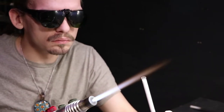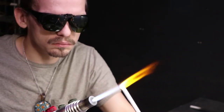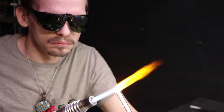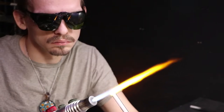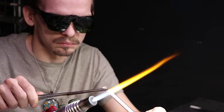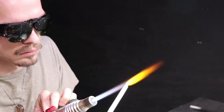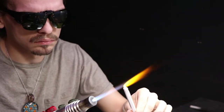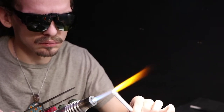And so in lamp working, I talk about this quite a bit, you have to be very careful with enclosing containers with air trapped inside. Most likely the vessel will be hot and the air will expand out of the vessel, so when you close it up and it returns to room temperature, it will actually be under a very negative pressure. The frit will help displace a lot of the air, however there is enough still trapped in there to cause weird things to happen. Once it's closed like this, as I begin to reheat it, it could actually pop or explode. So I'm working very, very slowly.